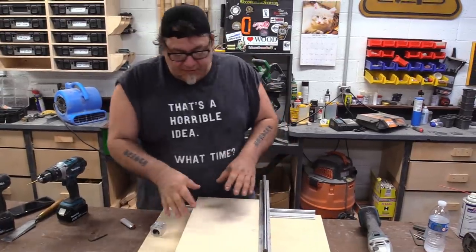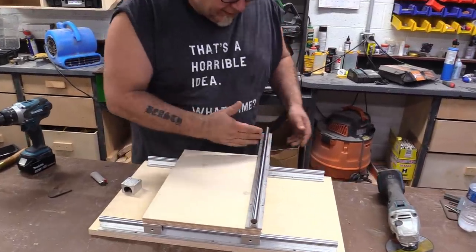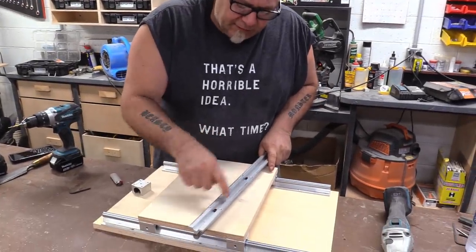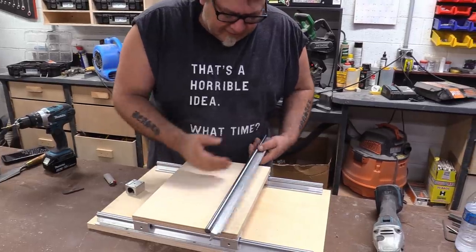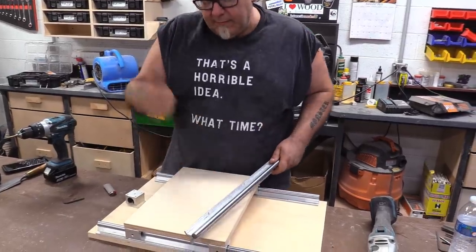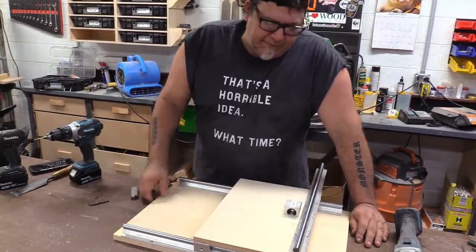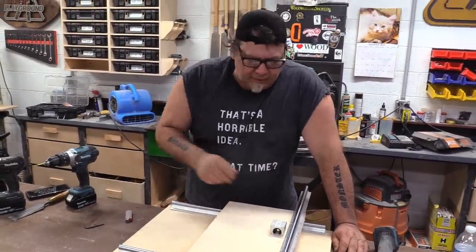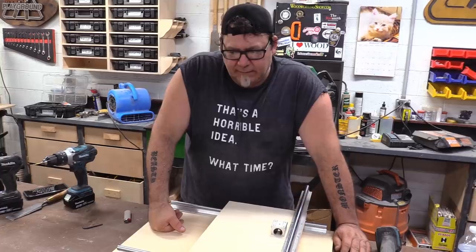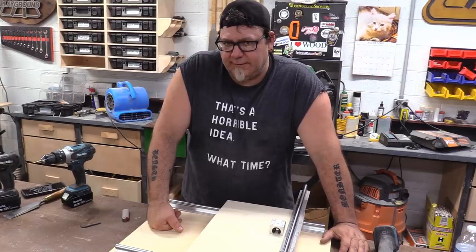So next step is pretty much just a rinse and repeat, but we're doing it on top here. What I need to do is cut these down a little bit. I don't want that full length of them. Handily enough, they have these threaded on here so I can take these bolts out. This pops off. This is stainless steel, so I'll cut this with an abrasive wheel. This is aluminum, so I'll cut that with the bandsaw. We'll do that for both pieces and basically just repeat what we just did. We'll have the base for the positive stop positioning hole drilling device, something.